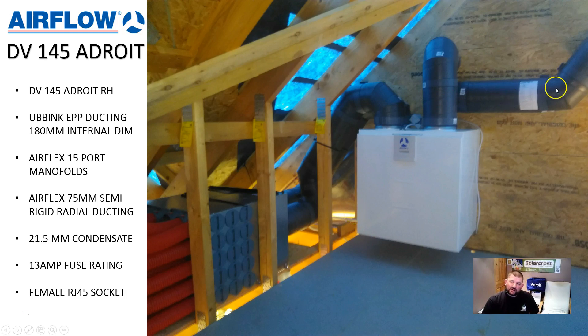I'd like to start by looking at what we call the atmosphere ducting here. Now these ducts are about 1.2 metres apart. Best practice is to keep these about 1.2 metres apart so we don't get any cross-contamination of airflow. It's also very important that they fall down to the machine so no water collects in reservoirs — so that means no U-bends. We can go up and over but we can't create U-bends like going down and then back up.